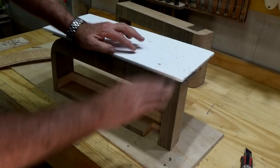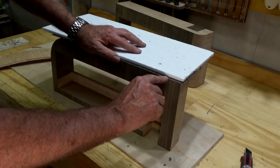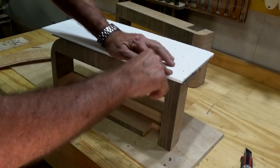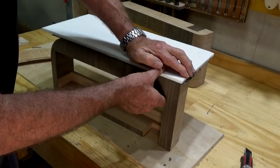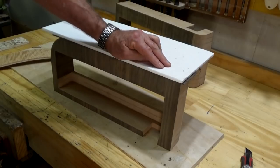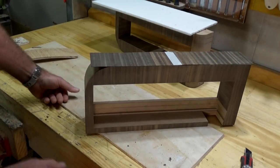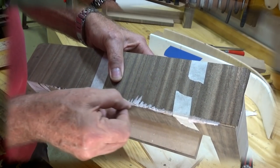What happened was that I had so many layers of stuff that I had to look after. The veneer slipped sideways and exposed an edge just here, which I didn't see until it was too late. The polystyrene foam is sort of flexible, and it gives a bit when you put pressure on it, but the problem is that at the corners, the strap clamp squished it so flat that it was starting to bend the veneer. The end result was that I took it out of the caul, and it looked okay, and I immediately spotted this problem here, which meant that it was ruined.